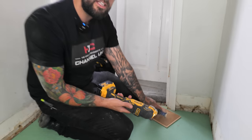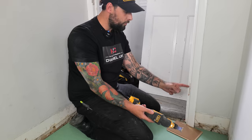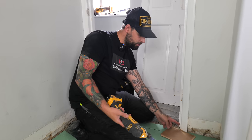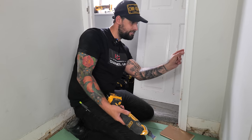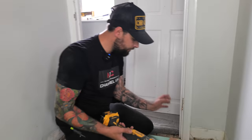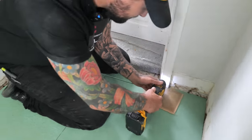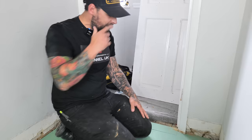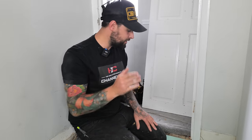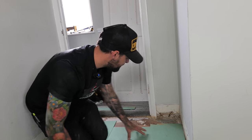I'm using this piece of wood as a guide for the height I need to cut. Because it's a door frame and this will be a different floor covering, we only need to go to the centre of the frame. Don't go further but make sure you go enough. Once you've cut 15 to 20 millimetres deep that's enough. Take a screwdriver and hammer and move the underlay back just to make things easier.